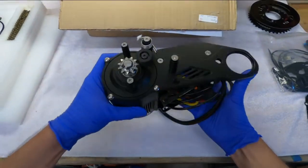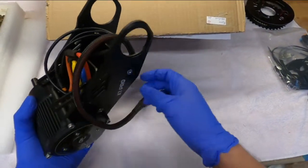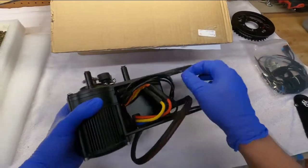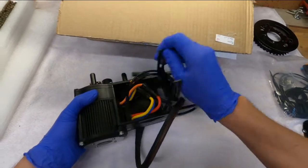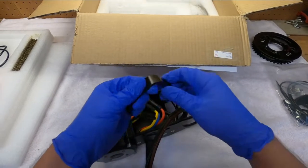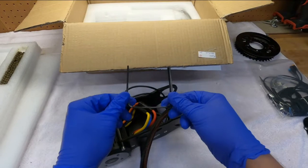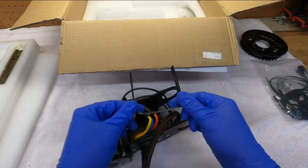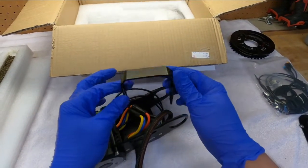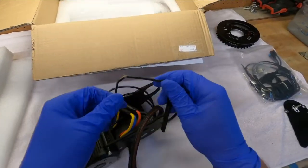And here is the best part — hardware is already falling out. I've got the little motor bracket that goes around the down tube of the bike. I wasn't particularly a big fan of the way this puts pressure on the down tube, so I think we're going to get the 3D printer out to make some kind of adapter to go from the circular frame to the square shape of this bracket. After hitting a couple of good bumps, the weight of this motor could easily put a dent in the bike — not ideal.